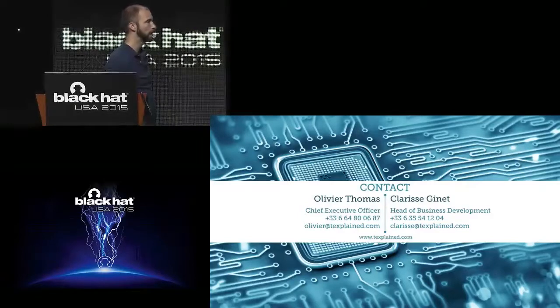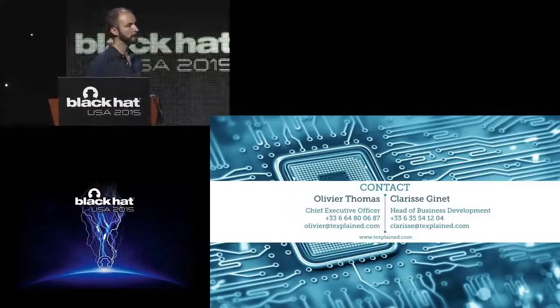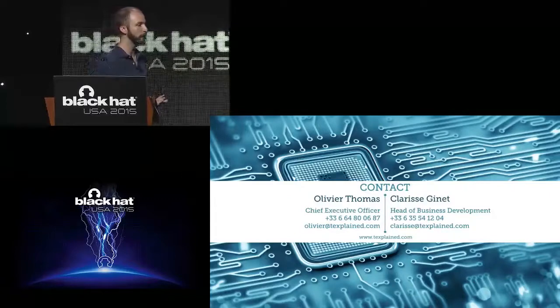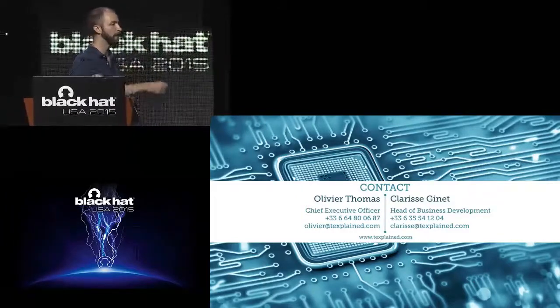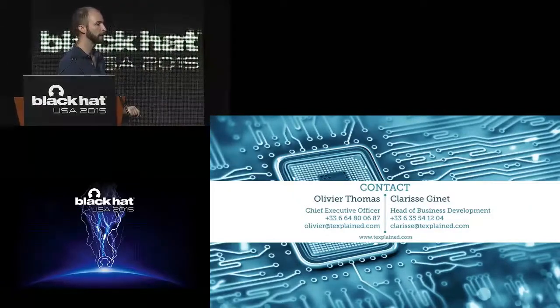Almost. So the question is, are the pictures enough to make a clone of a chip? Yes and no. It's enough to understand completely the architecture, to find all that must be custom. But you miss one thing, which is the memory content. For the memory content, if there is a flash or EEPROM, you need to extract it. And you can't image the bits inside the flash or EEPROM. So you have to use a focused ion beam and make an edit to be able to probe and get the data. But after that, it's enough.